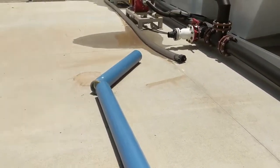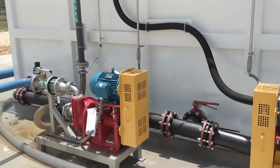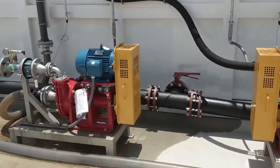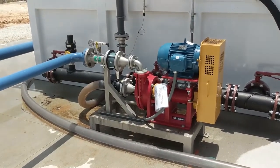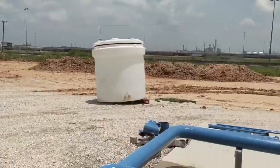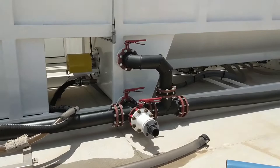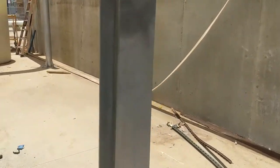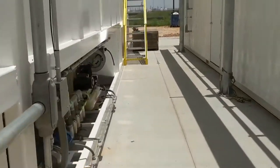Just a little bit of pipework as they finish up. Our unit ships complete with very little on-site modification required. These are our sand and waste pumps. A unique challenge of this site is they don't have a sewer, so we set this pump up to discharge into a waste lagoon on site. That allowed them to still utilize this technology without needing a gravity flow or sewer discharge. At 800 gallons per minute, we expect to waste around 50 gallons per minute of concentrated solids with this type of technology.